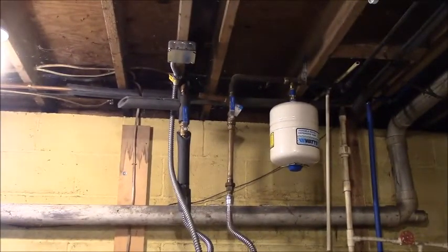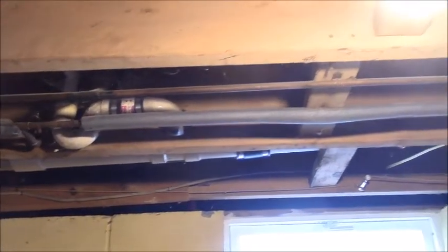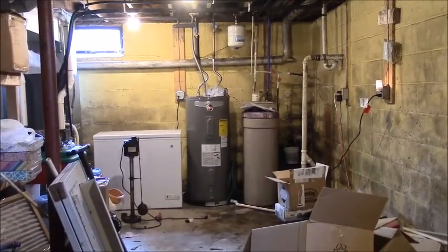You'll see it's a big mess but we're changing things around. The pipes for the bathroom sink go up here, so I'm going to put the water heater up between the joists somehow. I've got to run a 50-amp 220 circuit — like you'd run for a range or a welder — that size wire, I've got number 6 copper. These instantaneous water heaters are amazing; as soon as you turn the water, it's getting hot. I'm going to put it closest to the sink over here.